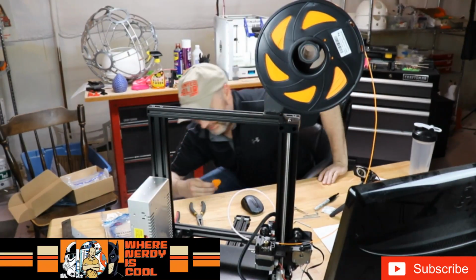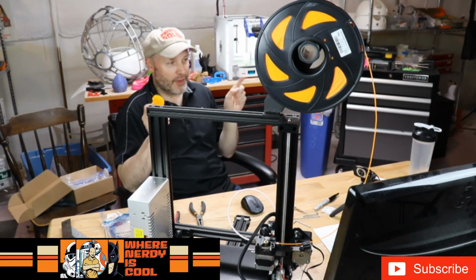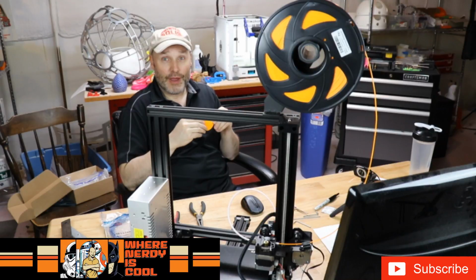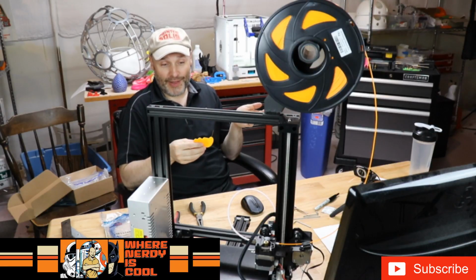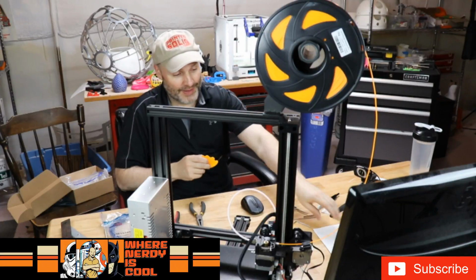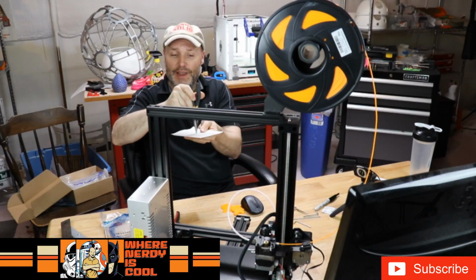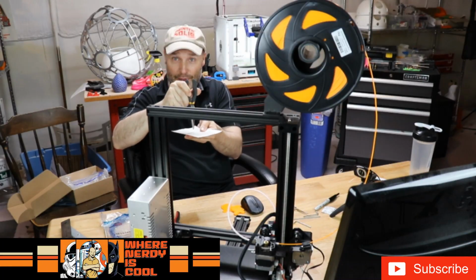And, all right, somewhere in here you can see me. All right, so what I've done is I had all four corners level. Usual way, you get the nozzle, you get the paper, and just when it's starting to leave a little bit of an imprint on the paper, that's when I called it good.